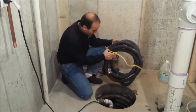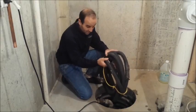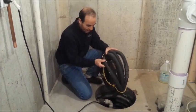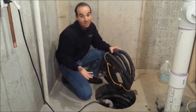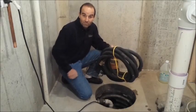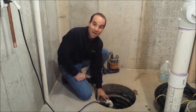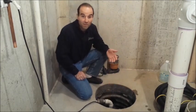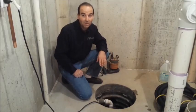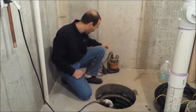Sometimes you'll have a hose like this with just black flex hose. If you do, that's okay, but this is going to be a little less reliable. You want to check this for cracks, and if you can, try to replace it at some point. Getting into hard piping is ideal. If you do that, try to stay with inch-and-a-half piping for most residential sump pumps — you can look at your sump pump and calculate what size pipe you have or want to use, but inch-and-a-half is a pretty safe pipe.